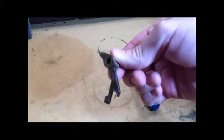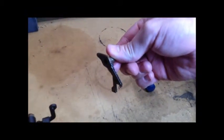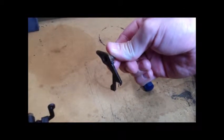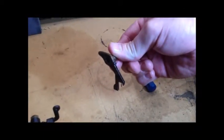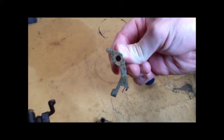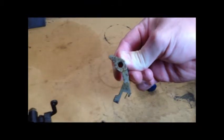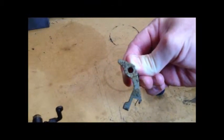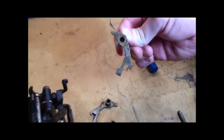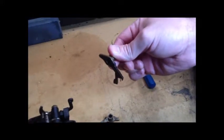The way this is made, there's a screw right there — you can see the screw head. They drilled this piece after it was formed and put that screw in. That screw holds the spring, and that's what snaps this tab back into place against that rack when you slide it. Of course, if you drill through a piece of metal that thin to put in a screw, that's where it cracked. This is not especially good metal — it doesn't feel like steel, it seems more like pot metal. I would say that tab design is a weakness of this machine.